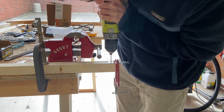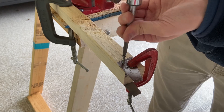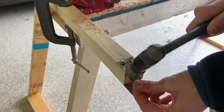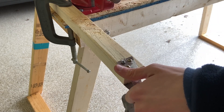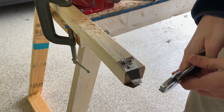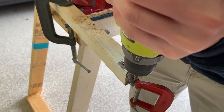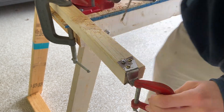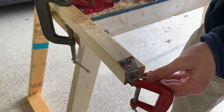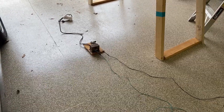The next step was actually holding that cutting wire in place, so this is where some pieces of sheet metal came in. Just drilling some holes and then putting in some screws — the screws anchored to the wood, but also give me a way of mounting the electrical wire onto this steel so that the electricity can be conducted through the structure and into the wire, hopefully heating it up. Another one of these brackets was mounted onto the lower side of the supporting arm, and then they are bent with a hammer so that they converge in the middle. By having supports on both sides of the arm, this prevents it from being twisted over time, especially under the tension this wire is going to be under. I'm bending out the sides at the lower end of that bracket even more, then clamping them together and drilling a hole all the way through. A small piece of electric fence wire goes through, and I bend this into place as a mount for the wire. On the other side I have a spring — and I do need to credit Grant Thompson for his video from many years ago that very much helped with the basic design, although this one is significantly scaled up.